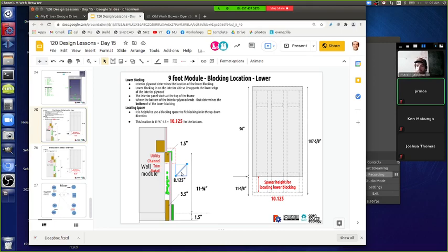So at the expense of this trimming job and getting that all closed up properly, we have the ability to run wires very easily. Like if you want to make an extension of your electrical system, say you do an addition, just open up the channels and run another wire through, as opposed to drilling a whole bunch more walls or opening up your drywall. So it's convenient to just run power in an accessible way.